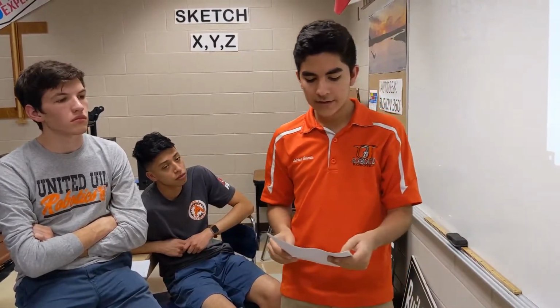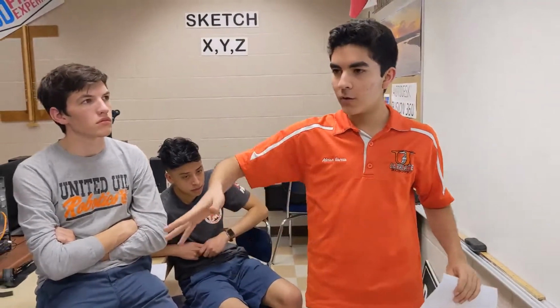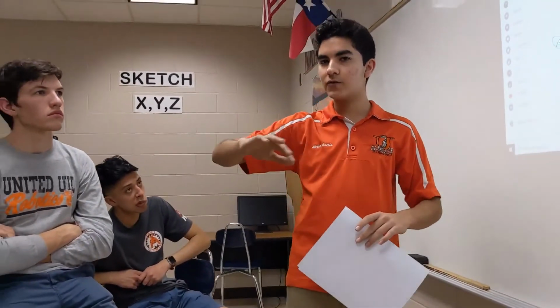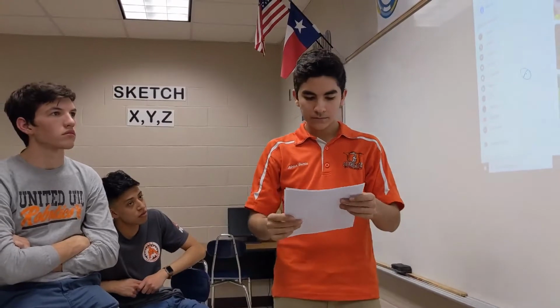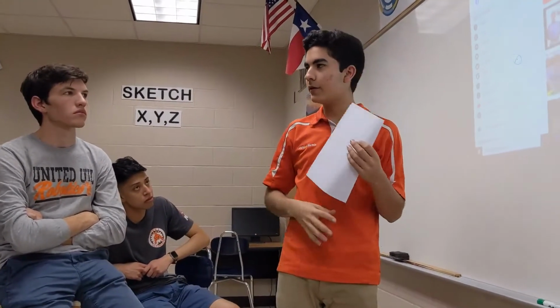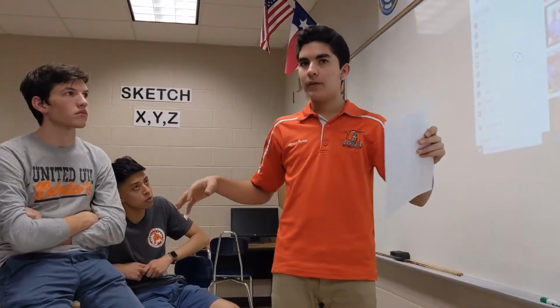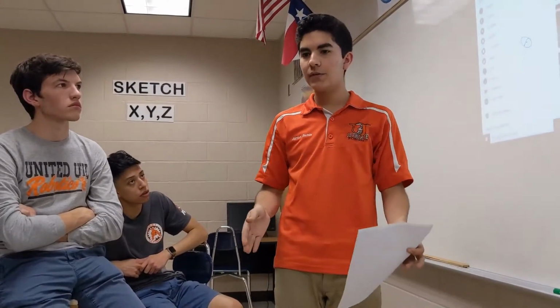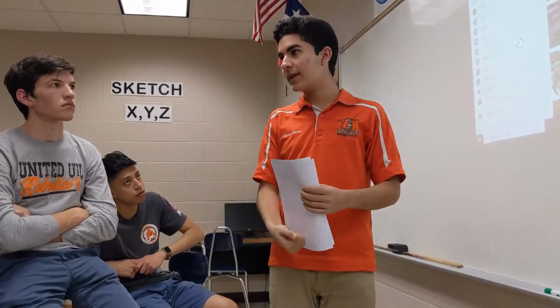We also utilized a front shooter with a front intake. That way, you drive up to the balls forward, and then when you go up, you're already ready to shoot, and you don't have to turn around or drive backwards when intaking balls. We also wanted to do a narrow configuration. That way, it's easier to go through the trench. It'll be a full perimeter, covered on all sides. We won't have a pass through. That way, it'll be more robust against defense.